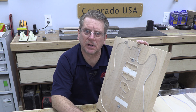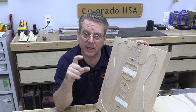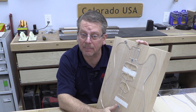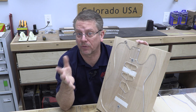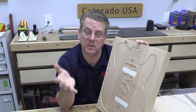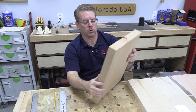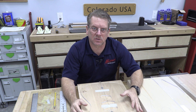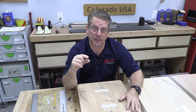It's okay to have a little respect for the power tool, but you don't want to enter it with fear, because fear can cause you to make mistakes and shy away from it. So I've been trying to figure out a better way for my students to do this. I reduced the router bit from a full-height bit where you take off the entire inch and three-quarters at once, to a bit that's only an inch tall and take it in two passes. That has helped somewhat, but it's still not good enough.